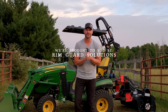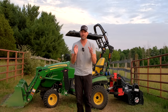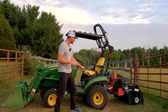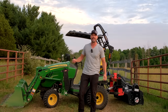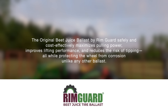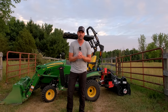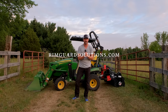We are proud to be sponsored by RimGuard Solutions, a ballast weight solution for your tractor. I'm all about safety and this is just a perfect match. Liquid ballast is one of the most cost-effective solutions - in fact, there's liquid ballast on this tractor right now, right inside these rear tires. It's hidden, it's out of the way. It gives you that extra stability when you're using the front end loader, keeps those rear wheels planted on the ground, and gives you traction when you need it. Why RimGuard? It is a natural product that will be safe around animals and livestock in case you get a puncture and it leaks out - meaning it's also safe on your wheels. The old calcium chloride will rust those things out and ruin them. It is also the heaviest natural ballast weight on the market today, available at over a thousand dealers nationwide. Head on over to RimGuardSolutions.com to find a dealer near you.